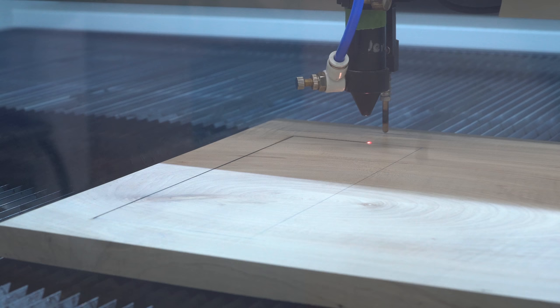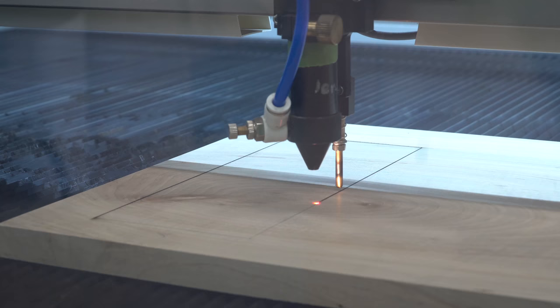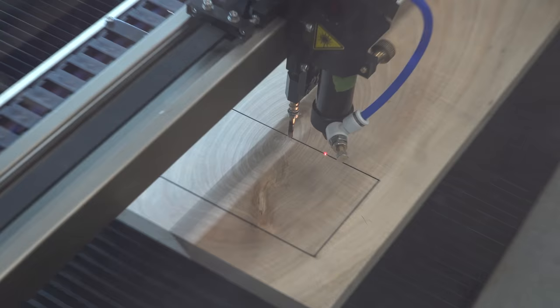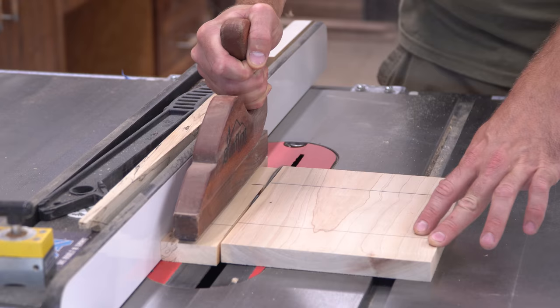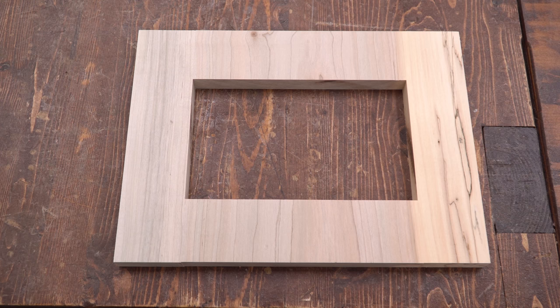Now I know what you're thinking — but I don't have a big fancy laser. Well, first, my name isn't Glenn, so I don't know why you'd call me that. Secondly, I only used the laser as a learning experience with a new tool I didn't understand very well. If you didn't like that, feel free to leave an unnecessarily aggressive comment below. Thirdly, I'm going to demonstrate the traditional way using my table saw, which leaves almost imperceptible evidence in finished furniture. Imagine this piece of wood is the side of the cabinet. Start by making rip cuts with the grain through the entire workpiece, then make the remaining cross cuts. Mark your pieces so you don't forget where they go. Now glue the pieces back together, lining things up as precisely as possible. After some sanding, those cut lines just about disappear and the center piece fits right back in. The thickness of your saw blade creates the space at the top and bottom — then you just trim the sides to match.